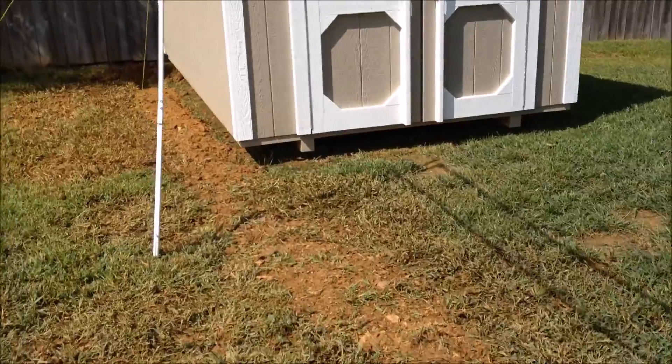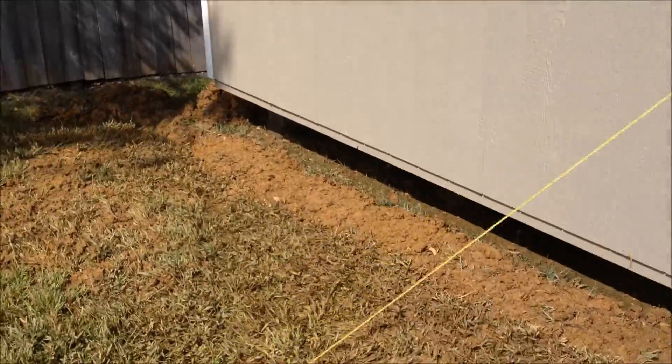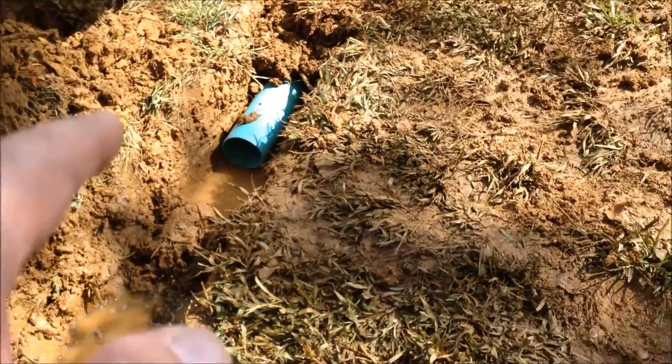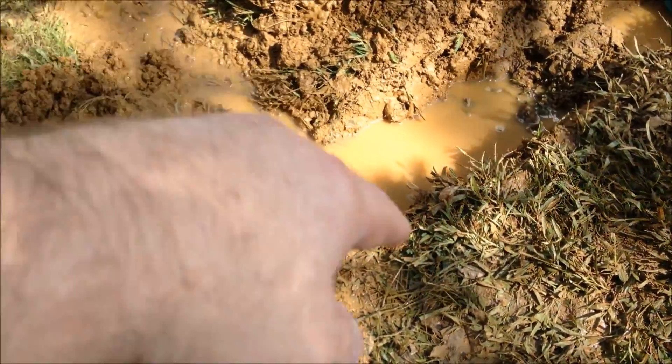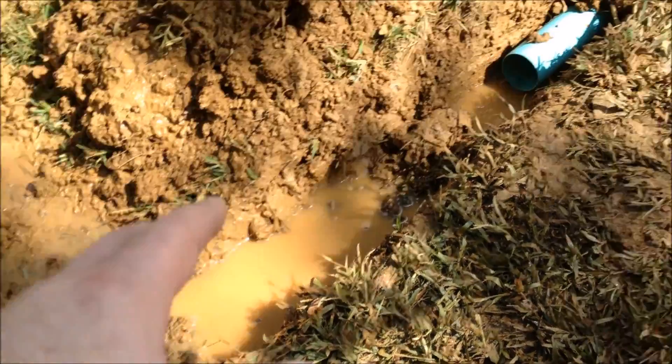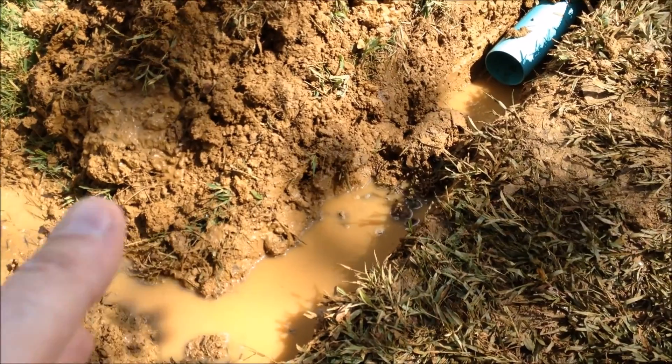I did the best job I could mashing this down all the way to the end, but it was tough because the ground is so wet — it just keeps clumping up; as fast as you mash it down it comes back up. At the end here, I went ahead and just left the pipe open and dumped a little mud in there to slow things down, and built a mud dam so the water can come down, swirl around, and go out into the ditch. I left it open because I don't exactly know where my large pipe will be positioned and I wanted it easy to connect and adapt. Now I'm putting the tools away, calling it quits — gonna take a shower, have a sandwich, cool off, and enjoy some soccer. We'll be back this afternoon if the rain holds off to dig the second one. I'm very happy — I didn't think I'd get this far today. Thanks for hanging out with me, see you soon, have a great day!